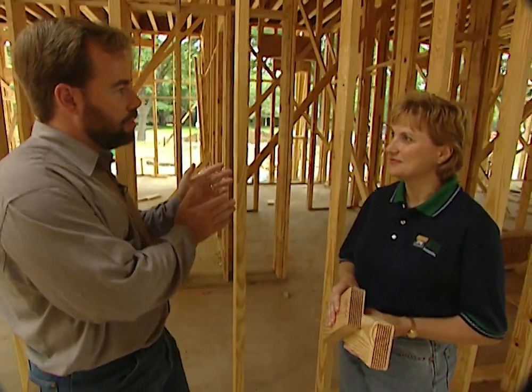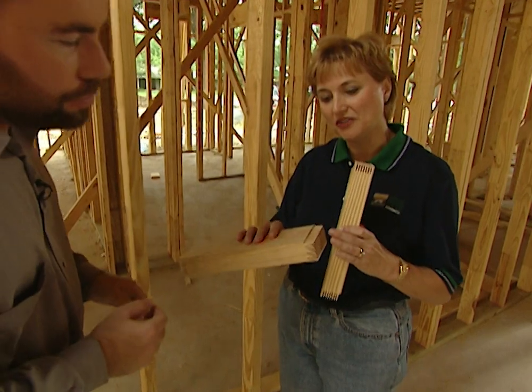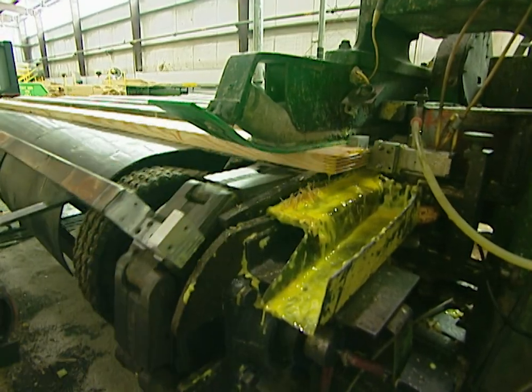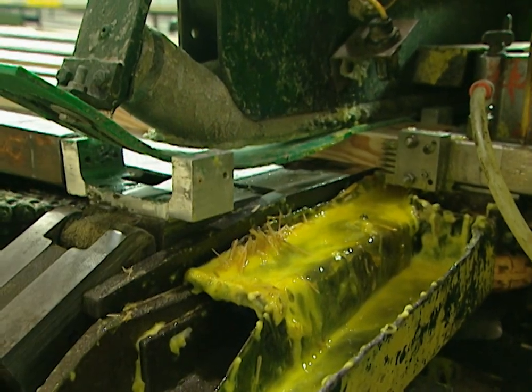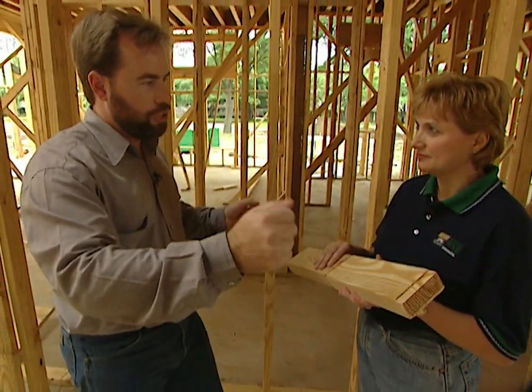So what would have been waste you actually make a real stud out of, and it's straighter and stronger, so when we look down a wall our walls are going to be straight. Right — it's much easier to put on your drywall and you won't have as many nail pops or callbacks. And it's straighter because it's made of a lot of short pieces — typically between 5 and 24 inches long — with a finger joint profile cut on both ends. Those pieces are put together with special adhesive, squeezed into one continuous ribbon, and then cut to the stud length needed.